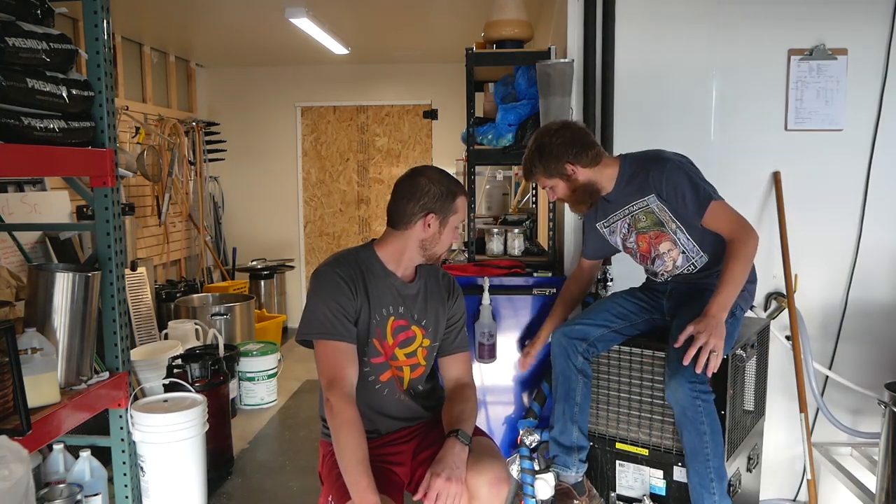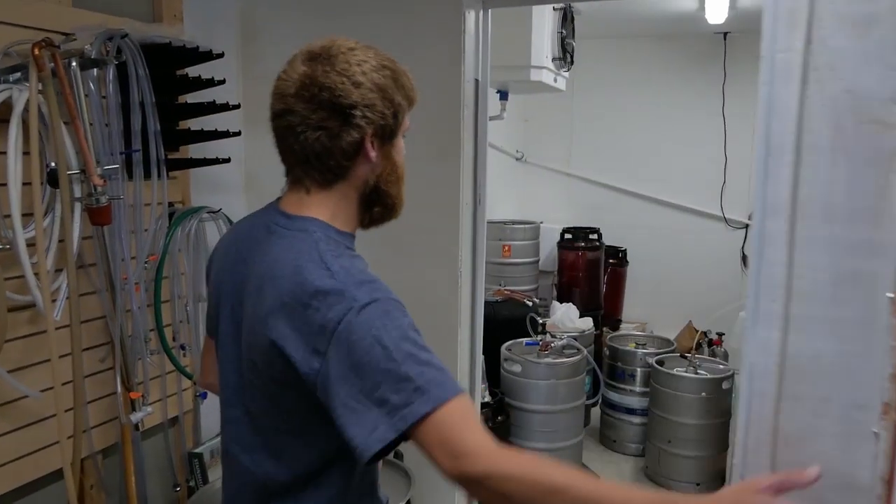All the Cryo lines we have are through morebeer.com — I'll link their entire page in the description below. That covers the basics of fan units and glycol chillers and what you should be doing for your brew house at commercial scale or building one at home. Let's jump into the install. Outside is pretty simple: I've got my pump on the side, and I've got some insulated lines going into three-quarter inch insulated PVC pipe, which run from my chiller into the cold room. There are also a couple shutoffs and an in-line filter — very important so we don't plug up those heat-exchanging fins.